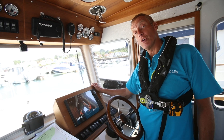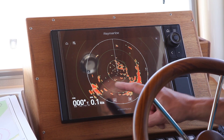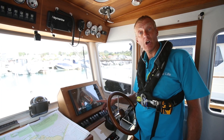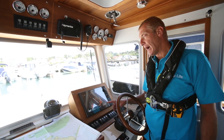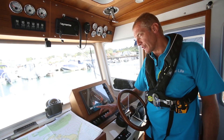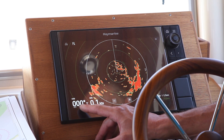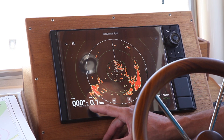We've got some soft overlay buttons shown here. We've got course over the ground, speed over the ground, and depth shown as permanent displays. And then in much smaller detail we've got how it's shown. At the moment the harbour mode is doing harbour transmissions — the radar's sensitivity has been adjusted by the manufacturer's specification to give the best picture in a harbour, so it's decluttering the picture slightly.